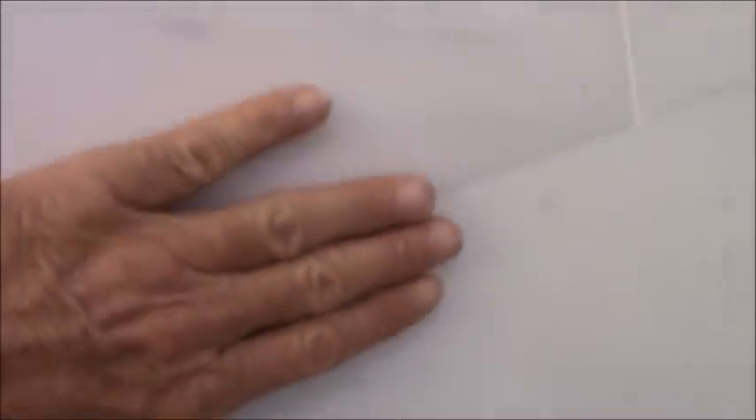It's the same reason I showed you on the other side. Another issue too is a large format tile centered down the middle here — the tile is not perfect, and this should have been cut into thirds. But I have a lot of customers who want them staggered in the halves like that, so I can't complain too much about that because I do the same thing. Again, lippage because they're sticking it straight to the wall.